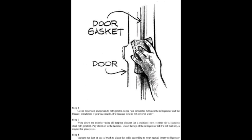Step 5: measure that distance down from the bottom edge of the painter's tape, and mark the wall. Again, use a level to make sure your wall mark or marks will be plumb with the marks on the strip of tape. Step 6: place the bottom of the hook at the wall mark. Hammer it in. For a light painting, a 6-penny, 2-inch nail hammered in at an angle will do. For more support, use a screw with a threaded anchor.